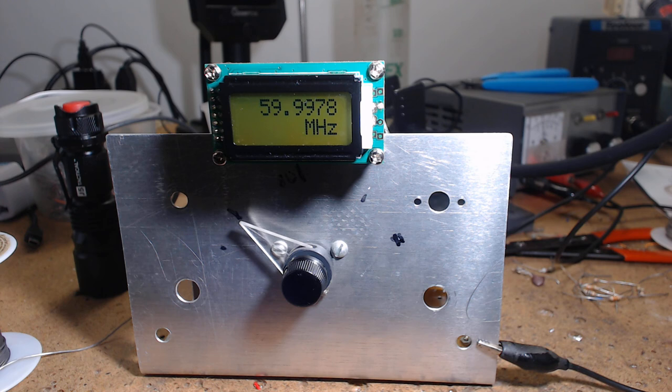So we started calibrating everything, and that's when you learn that just because something's digital it doesn't mean it's more accurate. Also, if it hasn't been calibrated, somebody could have singed one of the dropping resistors on the front end of the meter and it's reading wrong. I've found some of those — guys had the meter on the wrong scale, turned the power on, and fried some resistors. They didn't burn them open, just carbonized them, giving bad readings, and because it's a digital meter you assume it's right — not necessarily.